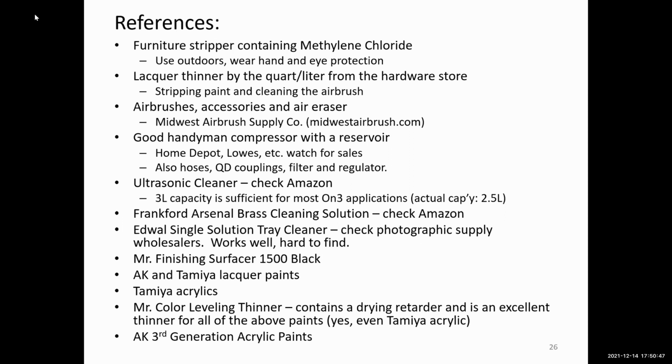Jake Swaney is asking about an air dryer, what method to use? There's two ways. One is at the compressor, which is where the heat is, so that's where you get most of the condensation. So you would just use a moisture trap, which usually has a Schrader valve on the bottom so you can drain it. The other thing is you can get a desiccant dryer that's in line.